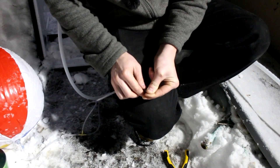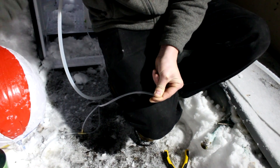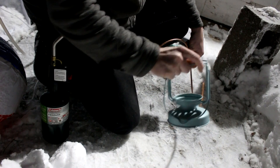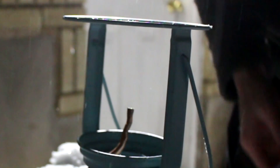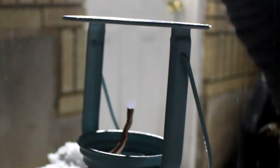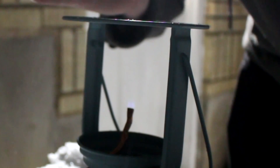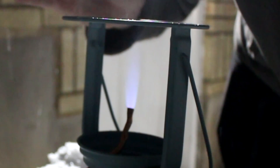I'm actually going to put this gas to work now because my storage is full and it'd be impolite to release it into the atmosphere. I've got this copper tube here — copper, unlike plastic, won't burn. I've got a little lantern case and I'm going to stick this tube in here. I've got the copper tube coming into the lantern, affixed to the top of this metal box. Let's light this on fire — I've got the gas hooked up to the tube. And there is a flame. It's a very quiet flame because that's about the rate the methane generator is producing gas, but if I push on the gas bladder, you can see the flame increases substantially.